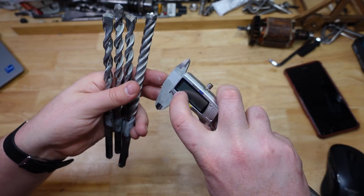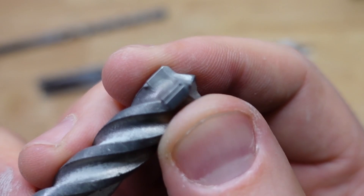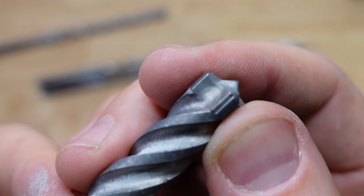Let's just see if they lost any actual diameter. Before use, drill bit one measured 12.28 millimeters across the tip; after use measured 12.22. Drill bit two measured 12.38 before use and 12.30 after. The centering bit measured 12.32 before use and 12.28 afterwards. Drill bit four, the Nemesis, measured 12.29 to start with and 12.26 afterwards. The Nemesis actually has little wear indicators on the side — still plenty of meat left on there. Good to go.